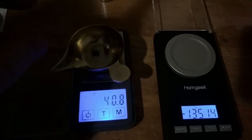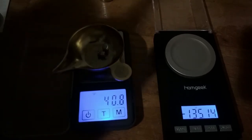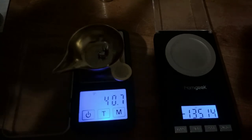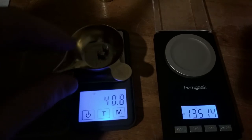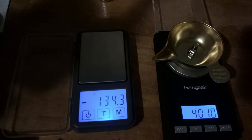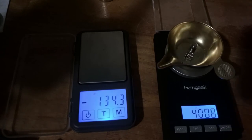We're just to the point where the drift is real. 0.7. Both of these manuals say that after a couple of measurements — specifically about 10 — you want to tare again with just the base scale. So basically you want to tare often. But this is where it's showing we're now off by a tenth of a grain. Try bumping it, see if that makes any difference. And it did.